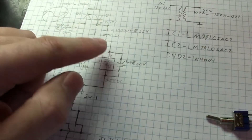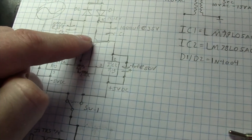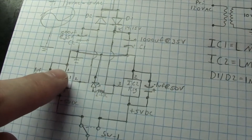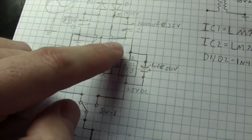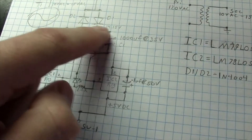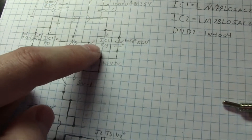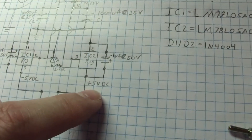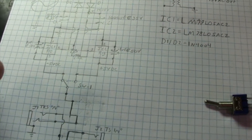I really like the 10 to 12 volt range — that's what I recommend. So you've got your unregulated DC voltage here, then it comes over to the regulator. For those that don't know schematics, I'm jumping over this trace — this is actually a ground reference right here, grounding the negative side of the cap. The positive runs down to this regulator on pin 3, and this regulator takes it and makes it a clean regulated 5-volt DC signal. There's a filter cap on the regulator output to prevent oscillation or any kind of noise.